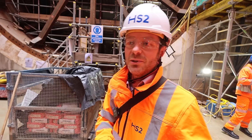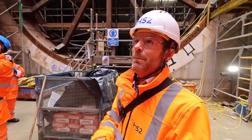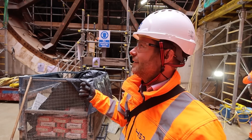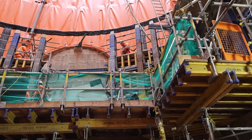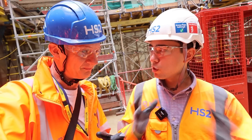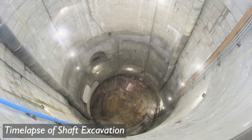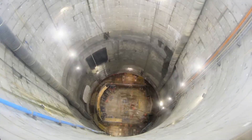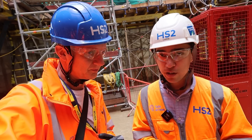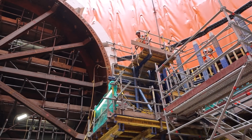So there's a bit of a dance between Norfolk Tunnels West TBM arriving, coming into the can which we've seen being assembled at the surface, being removed, can reassembled, and then the NTE — Norfolk Tunnels East tunnel boring machine — then arriving later, same process happening. We've got a lot of different strata that we're digging through to build this shaft. To actually be able to do that, we've had to install quite a few dewatering wells. You can actually see some in the shaft pipework — essentially trying to take that water from within the shaft, outside the shaft, and put it back into the ground elsewhere. And all of that is essentially depressurising and stopping the forces of that water pushing up against the bottom of the shaft.